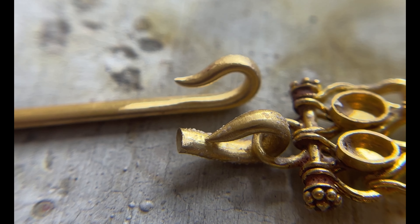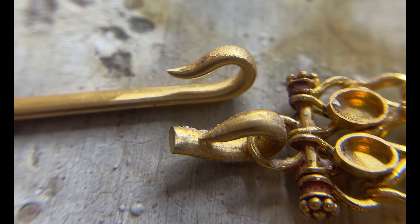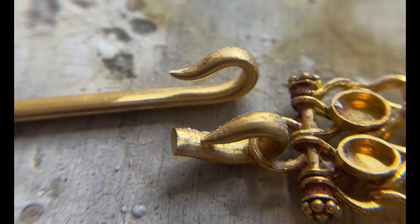I'm working on my other hook, and here's a little tip on getting things to match that I very rarely see students do. When I'm trying to make two of something, I often make multiples and just pick the nicest match. There's no shame in that. But when you're trying to match something, keep it on your bench absolutely right under your nose, because you would be surprised — even though you quote unquote know what it looks like — if it's not right there in front of you and you can constantly compare it to the one you're working on.